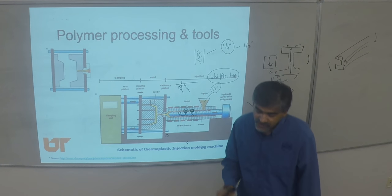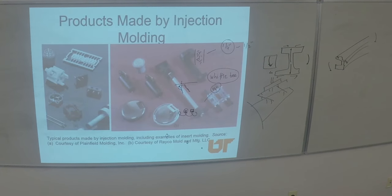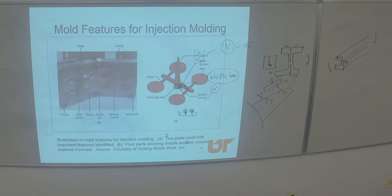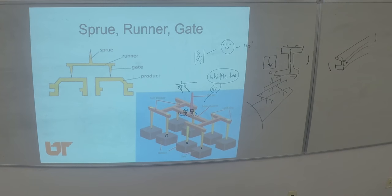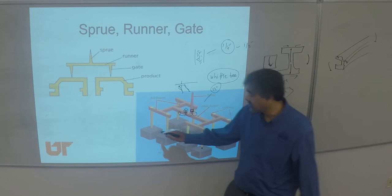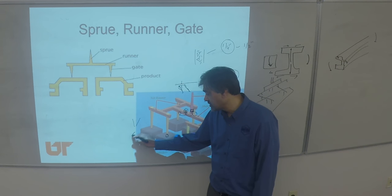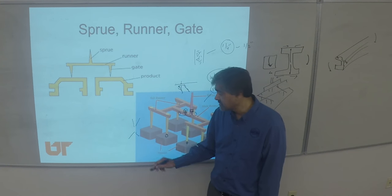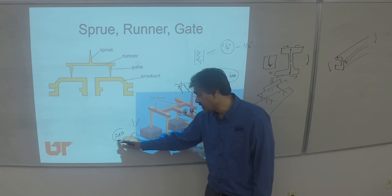You have to gently design the screw with enough clearance so the fibers are free to move and migrate down. Customizing a screw can cost between $8,000 to $10,000. You then have to use diverging gates instead of converging gates — these are called fan gates in injection molding.